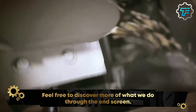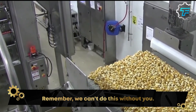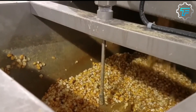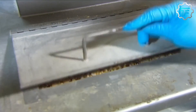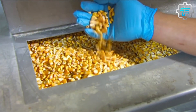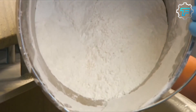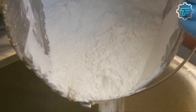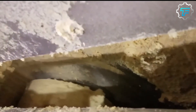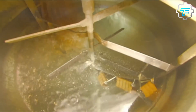The grains are poured into huge boiling kettles, where they are boiled for at least 20 minutes for two reasons: first, to soften the grains, and second, to allow them to absorb moisture, which is important in the dough making phase. Pre-measured quantities of lime are also added as the grains are boiling, which serves antibacterial functions, enhances the taste of the maize, and softens each grain's hard external layer to allow moisture to penetrate the seeds properly.